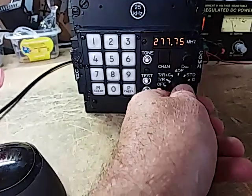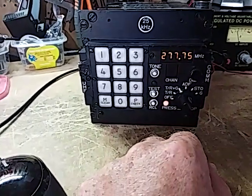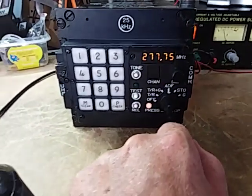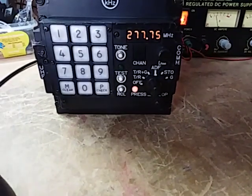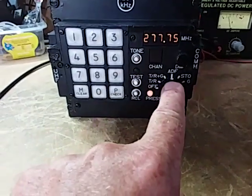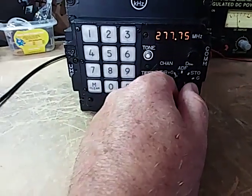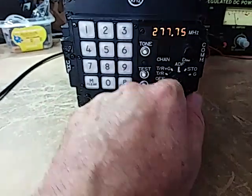The transceiver has several operating modes. You've basically got off, transmit, and receive. It has what they call a guard receiver built in, which is a second receiver on 243 megahertz — that's an emergency band. There's also an ADF section for direction finding, with a separate antenna jack for an ADF antenna. I've noticed that if I feed RF into the ADF input, I can hear the channel on the transceiver side. But if I feed the RF into the transceiver side, I can't hear anything on the ADF side — so there's some sort of antenna switching going on.